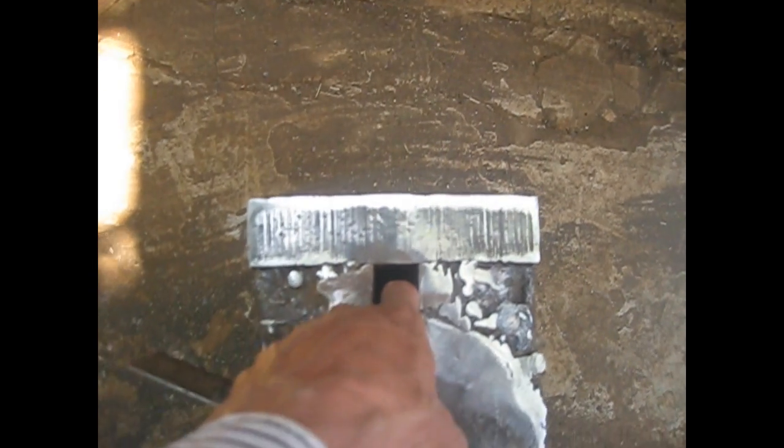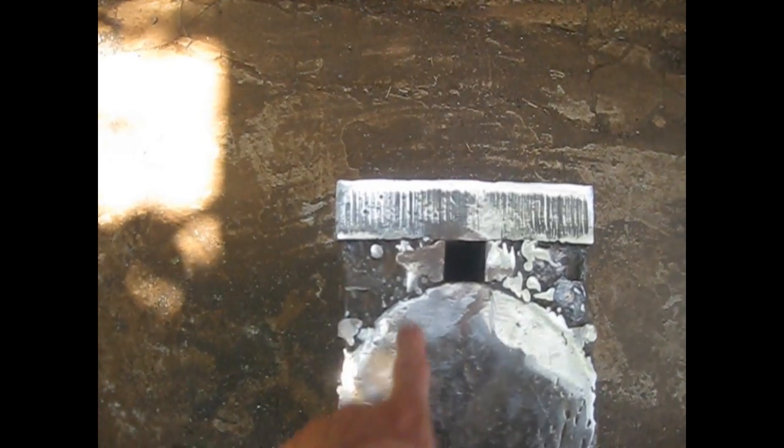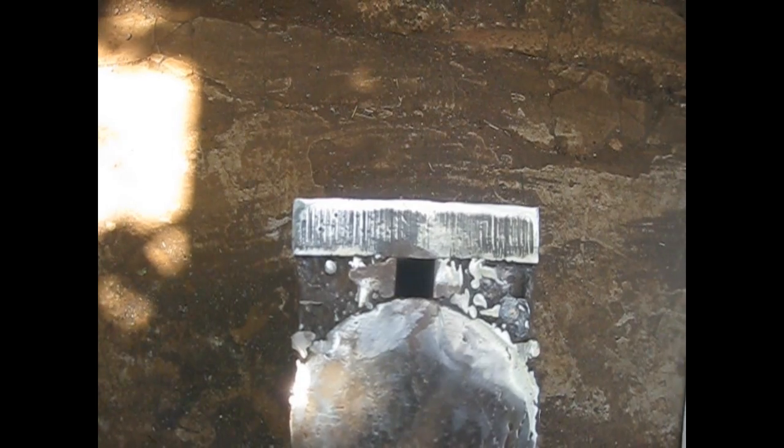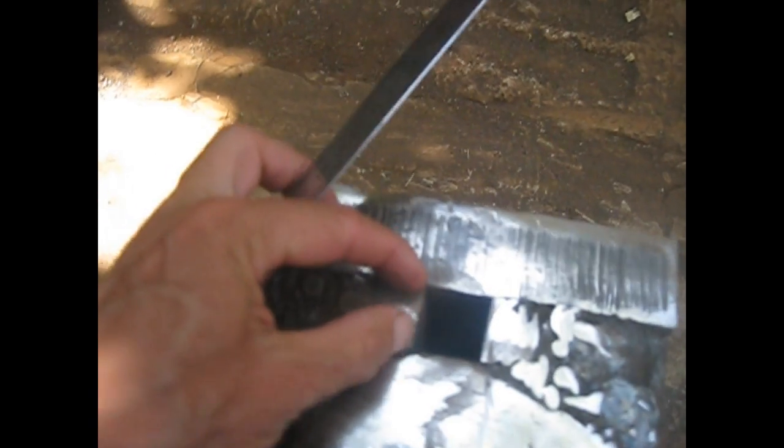This is due to two facts. First, probably the preparation of the hardy hole in the cylinder was not good enough. And second, because I used two bits of flat stock, 25 millimeters, that I placed here, with the heat and all the materials bending, they simply bent in this direction, where the back plate bent more. And this is a lesson.